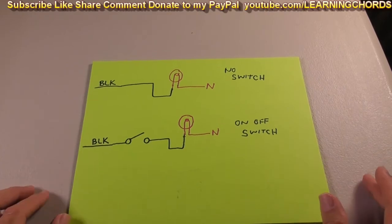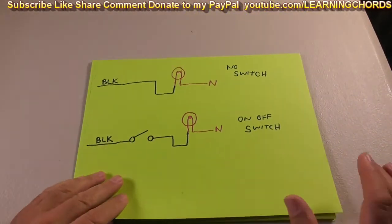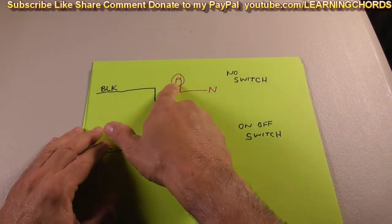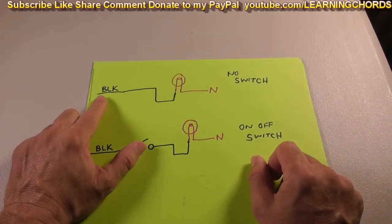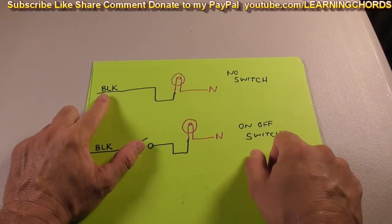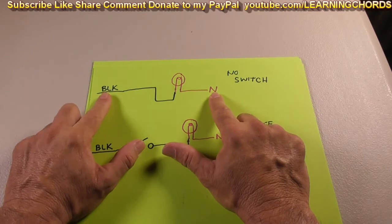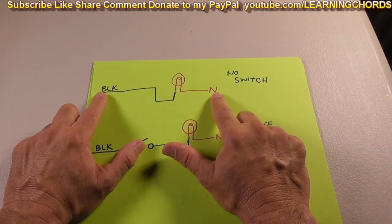So this is just a very basic circuit. This is a light. It kind of looks like a light. And when you have a light, you need power. In electricity and AC, black is hot, white is neutral, whereas if you do electronics, you know that black is neutral or ground, really ground, and white would be the hot. But in this case, we're dealing with black as the hot wire.